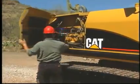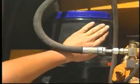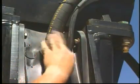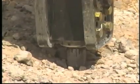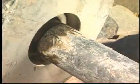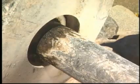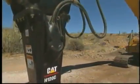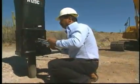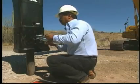For installations with an automatic grease system, confirm the system reservoir is full and that the system is functioning properly. Check the condition of the grease lines from the pumping unit to the hammer. For both manual and automatic grease systems, you'll know the hammer is sufficiently greased when a band of grease is visible around the tool just outside the bottom of the hammer following operation. As a general rule, manual greasing of the hammer is required every 2 hours of operation. However, you should always adapt greasing amounts based on the specific application demands.